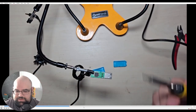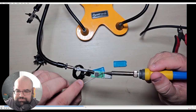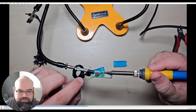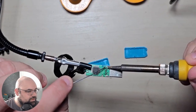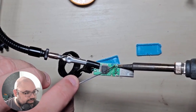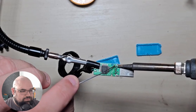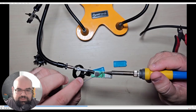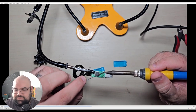Get set up here. If you look closely, I can zoom in over here. Quality drops, but you can see there's like no solder here at all. I don't know if this is all G90 cables or just my particular one, but I didn't notice this issue until recently. So I'm thinking it might just be wear and there just wasn't a ton of solder there to begin with. But just touch it up with a bit of solder.